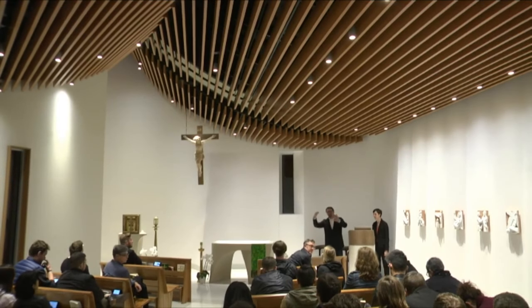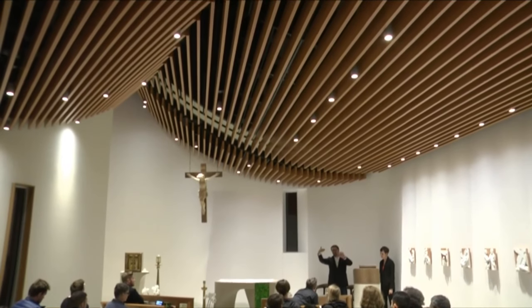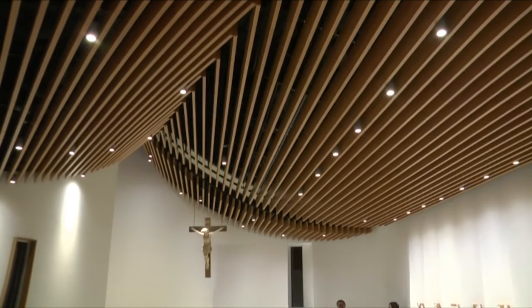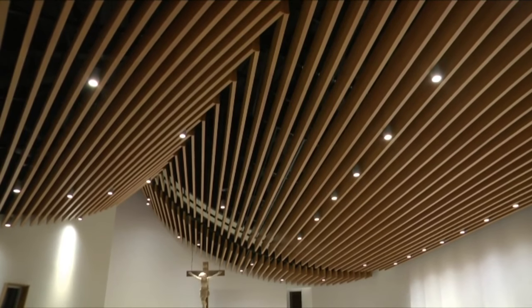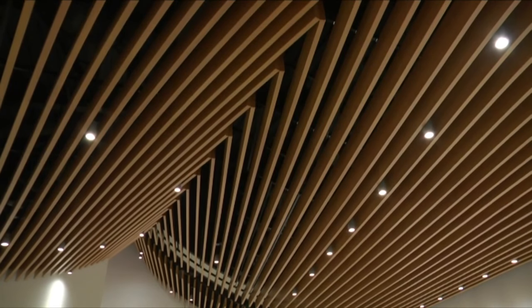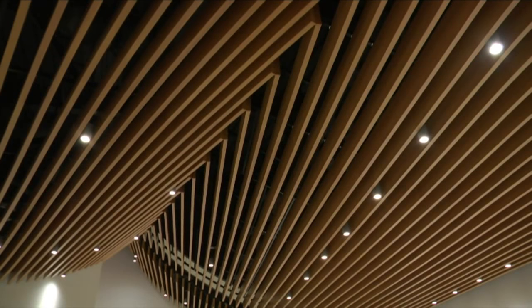So also it allowed the position of the slats in the ceiling to make a ruled surface, but also to reorient slightly on their oblique so that you're not looking up between them as you're coming in. And then this one also had a lot of work to get to the point where the ruled surface was also parallel with this wall in order to resolve all of the geometries that are coming into play. And then the other one, the far one, is oblique and it's getting clipped everywhere. But it also returns, once it gets around that corner, back up over the oblique window.